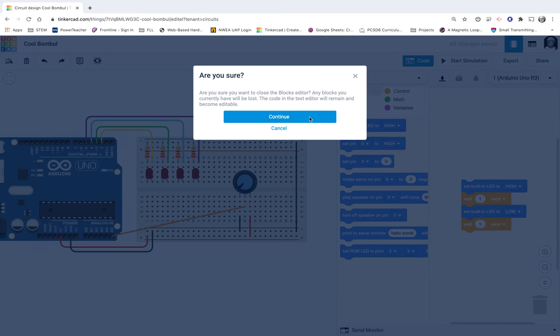I'll switch from blocks to text and get rid of the things between the curly brackets. A lot of people delete these curly brackets and replace them with parentheses or square brackets — remember, these are curly brackets, found on your keyboard next to the letter P. Let's go ahead and make some global variables. The things I'm looking at here: each LED is going to need to be used in both the setup and the void loop, and also my potentiometer. So let's name the potentiometer first — that's INT, pot pin, and that is A5.